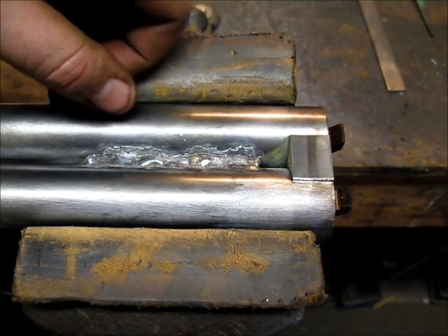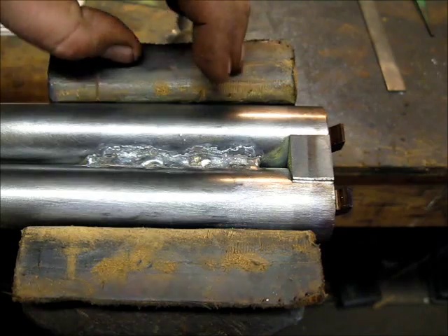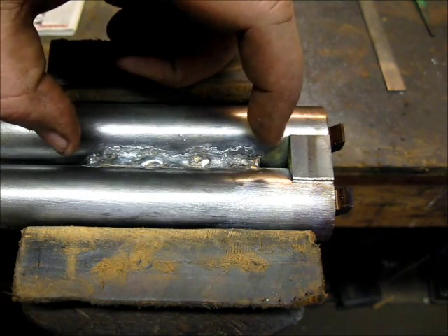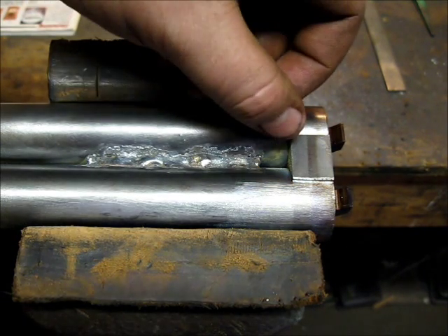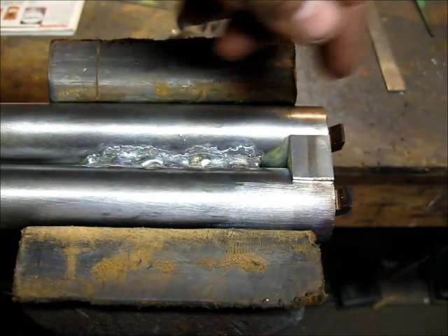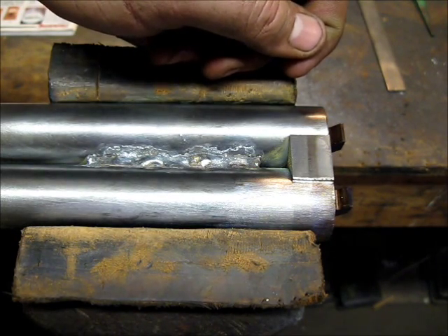You can see it's cleaned up now. My silver brazing isn't very pretty, but you can see I got a good tie-in on the edges — everything flowed really nice. I did this top and bottom, so there's quite a bit of braze in it — about two and a half to three inches. One thing I didn't do is go all the way back to the end; I left a little gap there because I don't want to run any solder up into where the breeches are. If I ever have to take them out, they won't come out if they're soldered in.